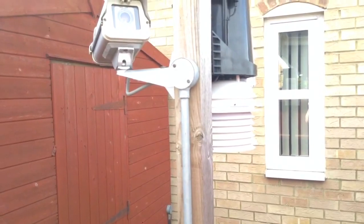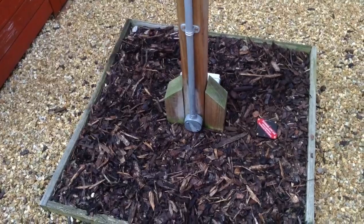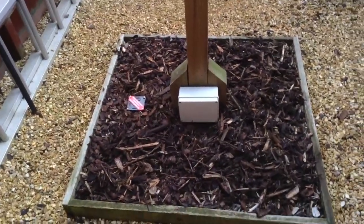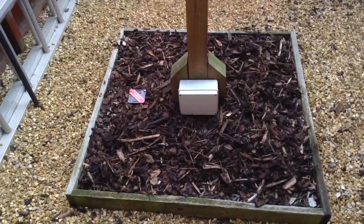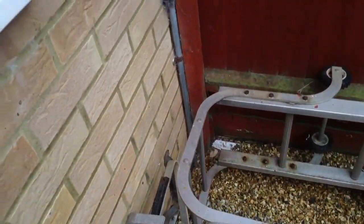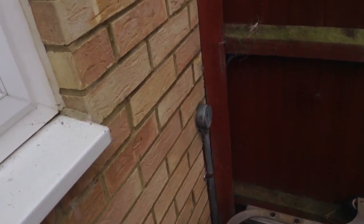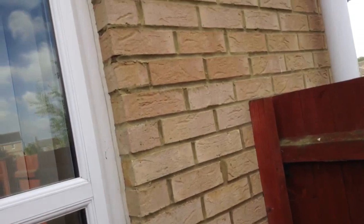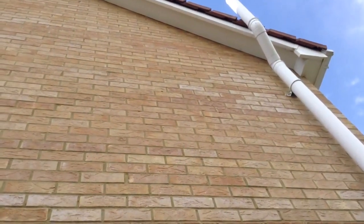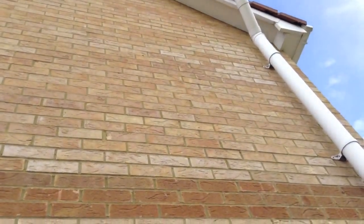I've just used a 3x3 wooden post and conduit down. It passes through the base of the unit and goes round to the enclosure there. This conduit goes underneath the gravel, comes up down the ladders, and then it goes in. From there it's fished up the cavity and goes up inside the wall, all the way up. Then I pick it up from inside the loft. On my little old humble website, theatris.biz.